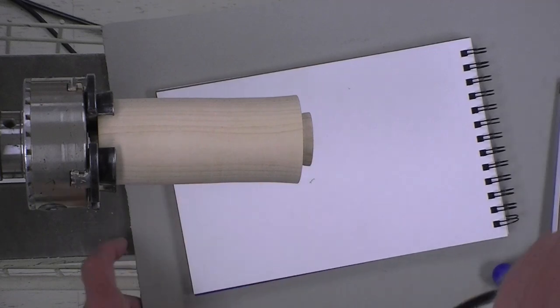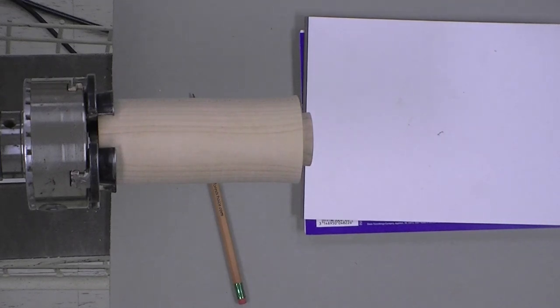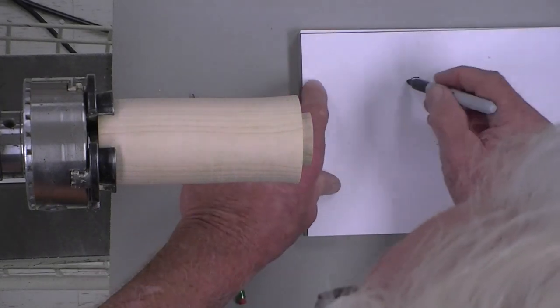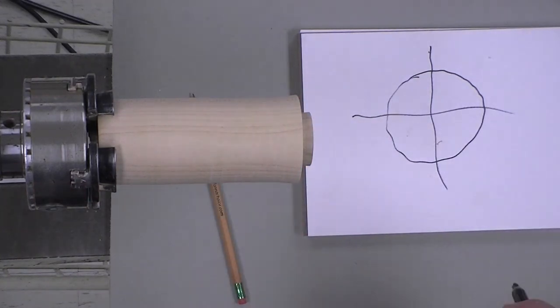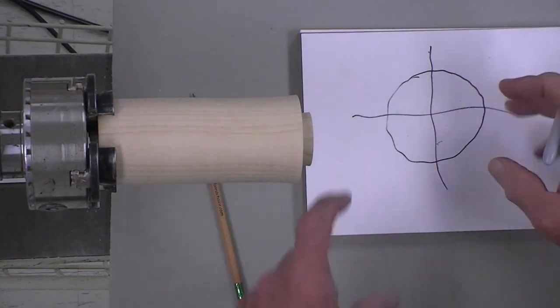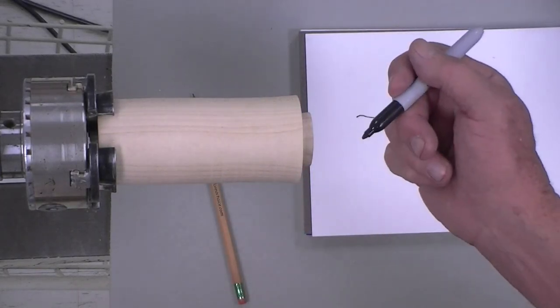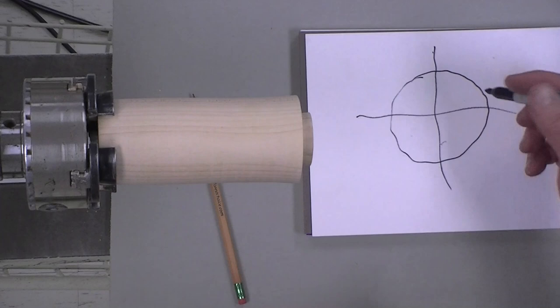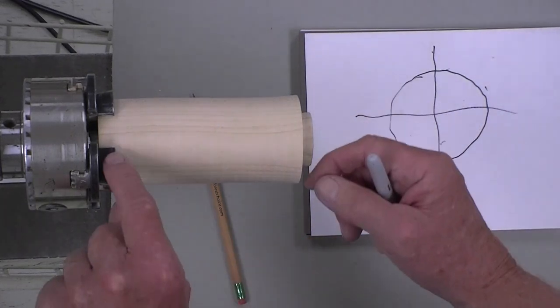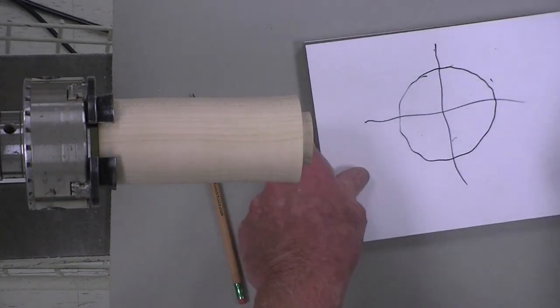The one thing you have to consider is, when they make a chuck, they cut it in fourths. So the tighter that is to where it was disassembled means that it's going to grip that tenon better than any other position. If you have a large tenon and you've got these short rungs here, it's going to grip it out here. There's going to be like eight different places it's going to grip it. So just keep that in mind.